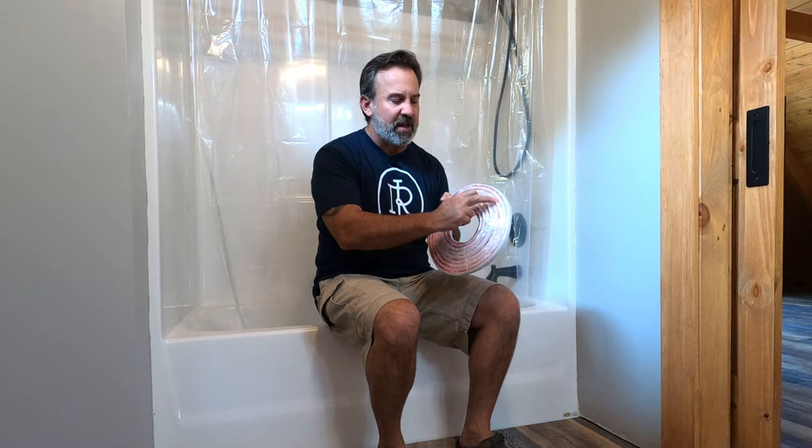And this is plastic, porcelain, or vinyl, and you can't nail a quarter round into it, but what you can do is get some of this vinyl quarter round. Guys, this is vinyl quarter round with a 3M sticky back on it, and this is white, matches our tub perfectly. You can get different colors, and you can see it's got like a red gel-like material with a 3M sticky on it, and we will put this on the tub or shower base, and it will stick to it, keep water out from coming on the top. And of course, sit right on top of our vinyl plank flooring. It's not going to be putting any weight on it, no pressure, but will allow that expansion and contraction to work perfectly.